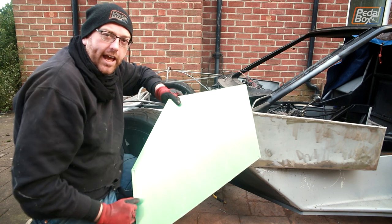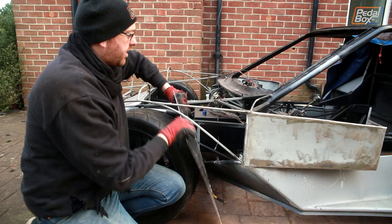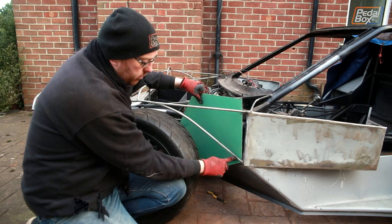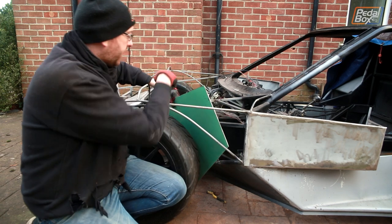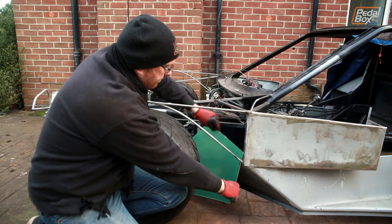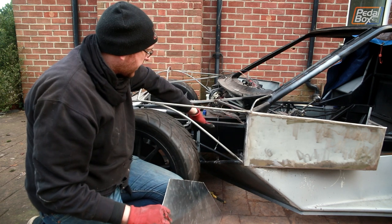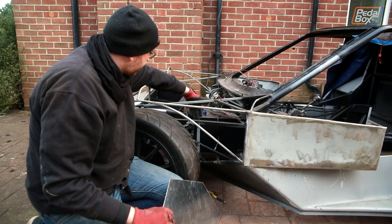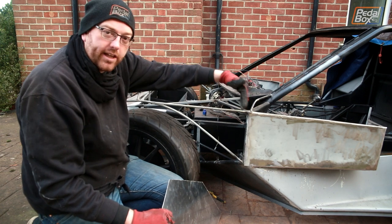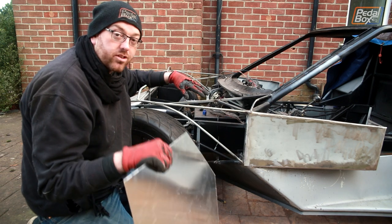This funny shape is the basic layout of the inner panel. This edge across here matches up with the edge of the side of the car and fits in like that. We've got bolt holes down here across the middle, then one right in the centre where we put this little flange in order to bolt the front edge on, and then another piece will go along the front inside where all the suspension is.